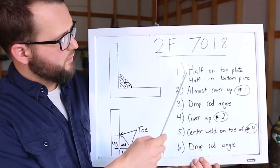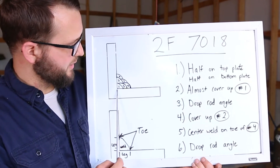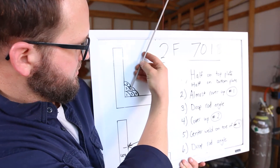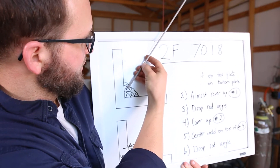For the first weld, we want half of it on the top plate and half on the bottom plate. A lot of people come in way too steep right off the bat. What I always tell them is to start dropping their hand — sometimes even a little farther than you'd think — and that forces weld metal up on the top plate rather than putting everything down on the bottom. It's also very crucial that you hold a tight arc. If you long arc, the amperage spikes and you'll cut into the top plate, so hold a very tight arc.